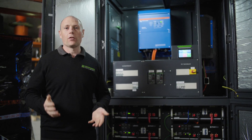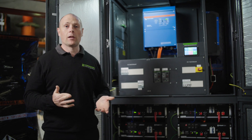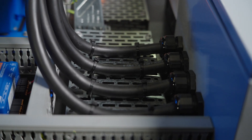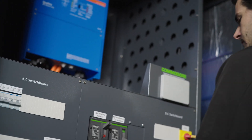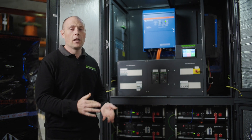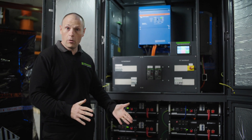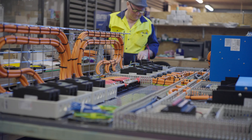One of the biggest advantages of our PowerHub cabinets is that it takes all of the complexities involved in an off-grid system — there are hundreds of components and details and over a hundred checks that we make when programming and testing these. That just makes life so easy when it comes to installation. You get these on site and all the hard work is already done: connect your solar in via the side, add the batteries, connect your generator, and connect your subboard.